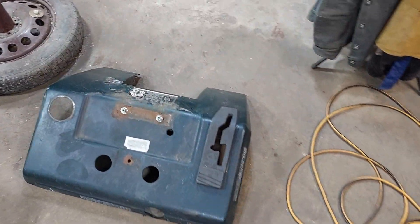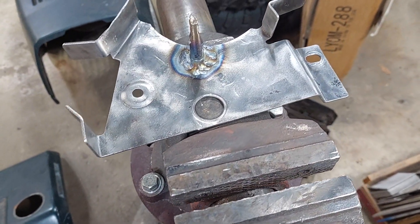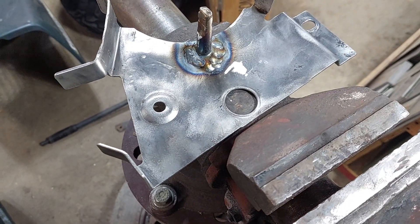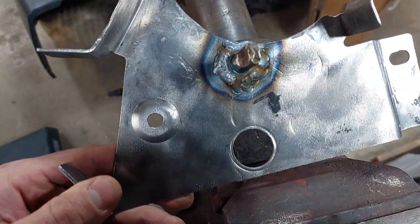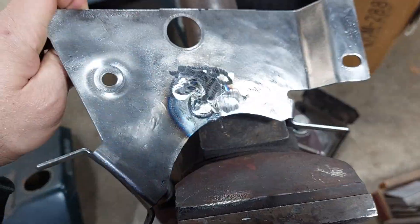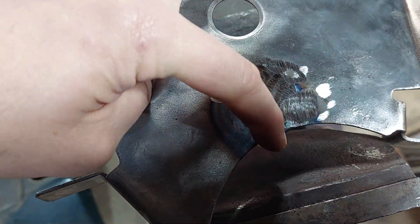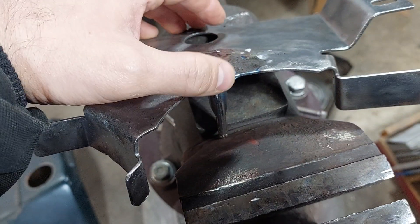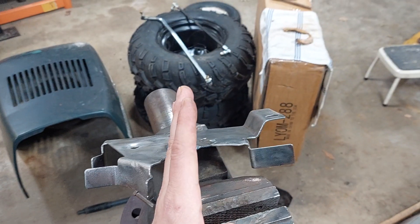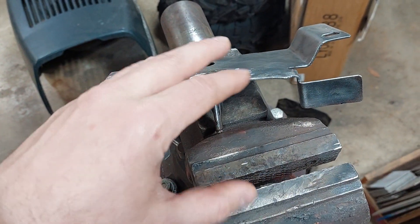Mowers, tractors, cars — stuff's got to get replaced, maintenance has to be kept up. In finding that bad bearing, I also found the belt keeper was mangled. I took a wire wheel to it mostly to get all the gunk and grime off, and it stripped the paint, so I just field-stripped it — took about five minutes. I welded it back up, bent it all out, welded the stud back in place. This was cracked, the keeper stud was bent all wonky — it was supposed to be straight up and down — and the bracket itself was bent, so I straightened it out as best I could.